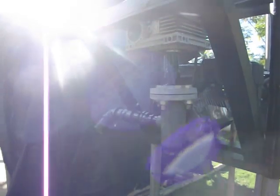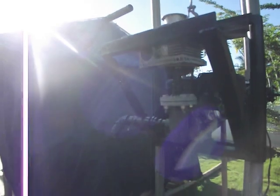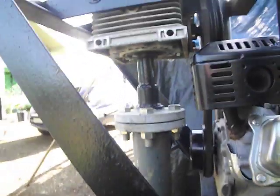That's kind of the speed I would be drilling at. I'm not going to do a proper hole because I don't want to connect all the water and dig all the holes up for the water recirculation and make a mess. So I'm just going to put a length of pipe on and show you it actually going into the ground. It's really heavy clay here and because we've had a lot of rain it is really heavy — it may only go in about a foot or so. Because it's not being cleaned by the recirculating water it will clog the end of the drill up quite easily, so it really needs the water circulating to make it work. I'll close it down to tick over — you see the clutch is working there so the head's stopped drilling.